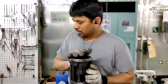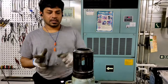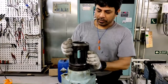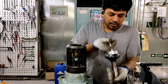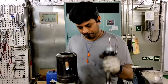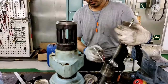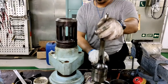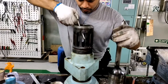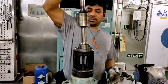Okay, now we are done with our cleaning, done with our lapping and everything. Now I will show you how to assemble it. Assembling this is very simple. All you need to do is pass through — make sure your spindle is free of any kind of dirt, lubricated properly, and the inner surface should be lubricated properly, so you can drop the valve in.